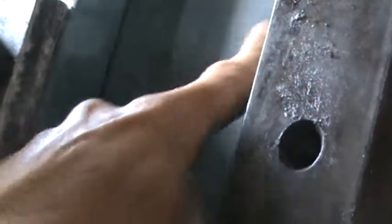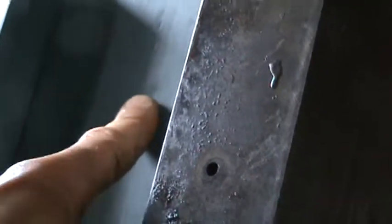Here we have another turcite piece — I've already cut the groove and glued it in. And this is a side turcite, also new, just pulled out. I have to cut the oil groove here and here. This is where the oil is going to come from, and I have to open the hole — drill through the turcite to open the hole.